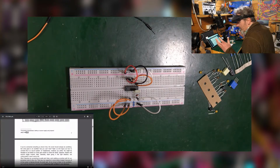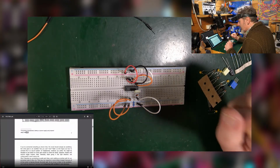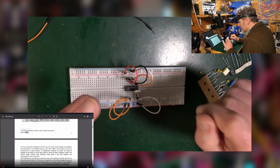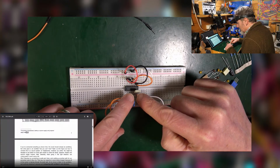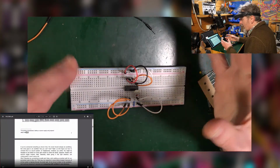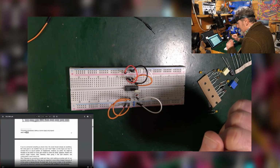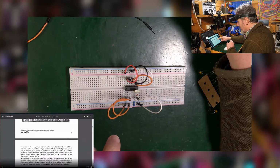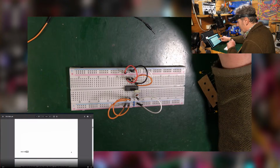But what good is an oscillation if you can't hear it? Yes. So let's figure out how to connect it to a sound system or headphones, whatever you prefer. You might be tempted just to attach an audio socket where the diode, capacitor, resistor and Schmitt trigger inverter meet, this space right in the middle. That's going in the right direction, but it won't work, because everything will just go shooting off down the audio socket, as that becomes the place of least resistance. Our capacitor will never get charged because all the current is going through the jack, because we are tampering with the oscillator's core structure. Interesting, okay. So to avoid that, we need to use a buffer.